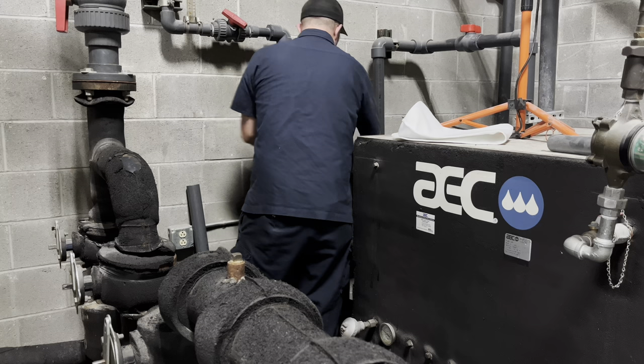The last thing for this compressor is we blow out the condenser. This is responsible for cooling the refrigerant — both for the drying circuit and the oil for the compressor — just like your car's radiator. It sucks in ambient air and cools the internal components. There's also a fan and a separate radiator specifically for the refrigerant on the condenser. I'll let it build up a bit of air to help clean itself — you'll see a plume of dust come out.